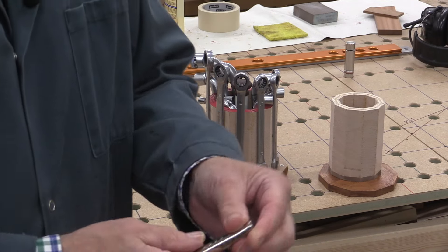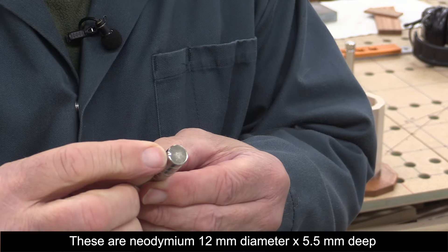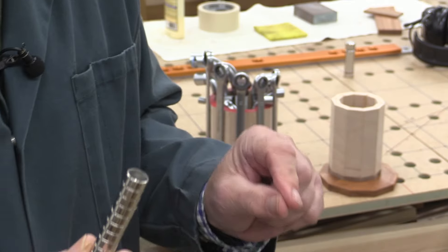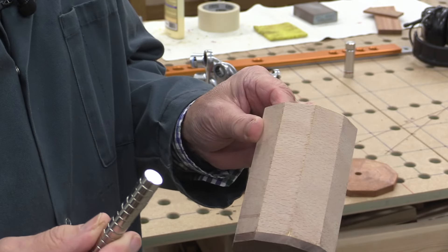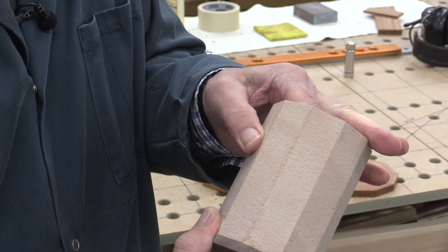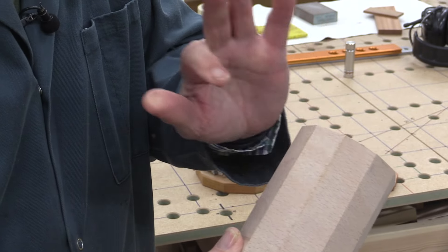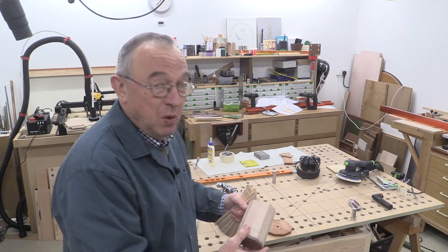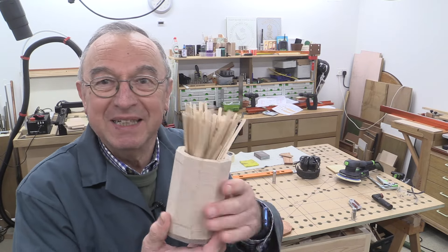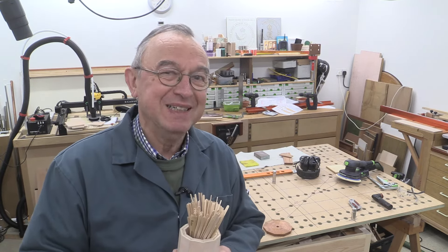If you decide you want to have tools on the outside using magnets, the magnets I use are 12 millimetres in diameter and approximately five and a half millimetres deep. I chose that size because a 12 millimetre forstner bit going down five and a half millimetres is a piece of cake. I then mix up a tiny bit of Araldite to go in the hole first and push the magnet in. You can clamp the magnet in place whilst the Araldite's going off, just in case there's a hydraulic effect pushing the magnet back out. I've put a bottom on this — just a spare piece of wood — and I'm putting all my glue sticks in there. That's going on the shelf behind me. Many thanks for watching, take care, bye bye.